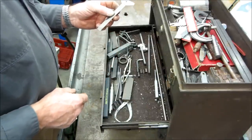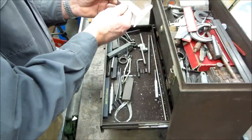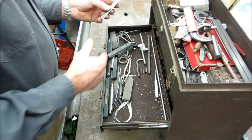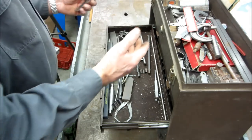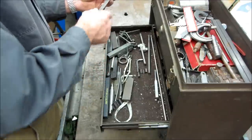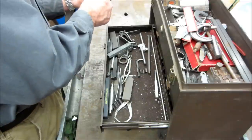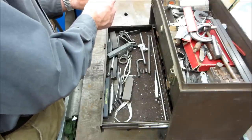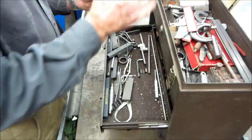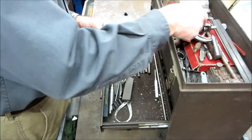Here's another drill gauge, and I have a couple of drill gauges right now. This has it on here — this is Standard Tool Company, Cleveland, Ohio. Twist Drills, Reamers, Cutters, Special Tools. I'm gonna be breaking this out again in future videos. Everybody wants to see tool sharpening. Here's another great handy tool — these are different angles. You got 118 degrees there, 135 degrees here. I'll get into explaining those angles and how you can use this gauge to make sure your side-to-side is equal — that's how you get two chips to peel out at the same time. Very important gauge to have.